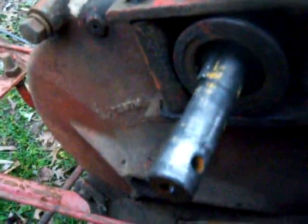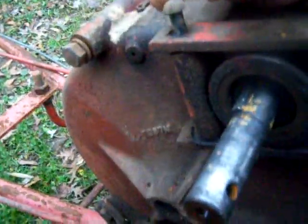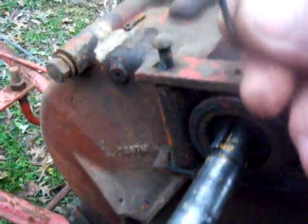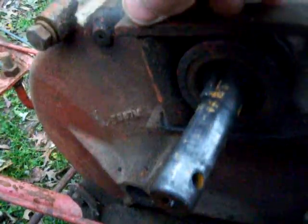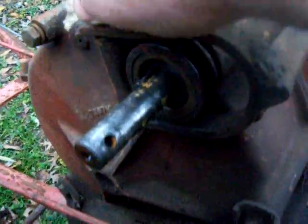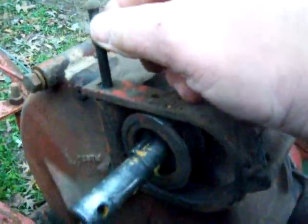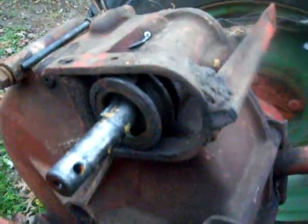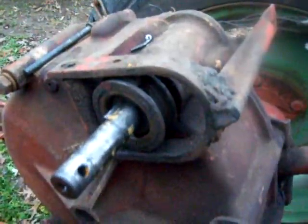Your pin here that goes through the yoke down to the bottom has a cotter pin on the bottom of it — a small cotter pin. You get to it from the bottom and pull the cotter pin out. Try not to shake this or pull it around too much as you're doing this. I'm doing it one-handed here, so I hope I can do this. Once that pin is out, you've got to start being very careful because things can start falling out on you.